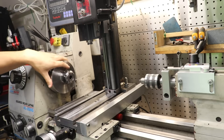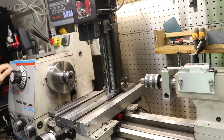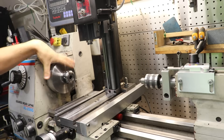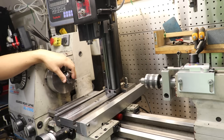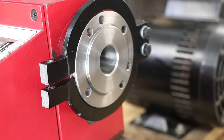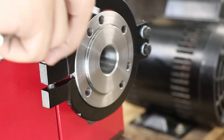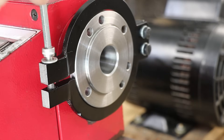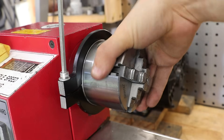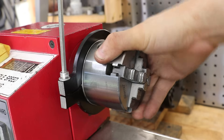However, it's not so straightforward because in addition to doing all the drilling and the milling, I also need to index and rotate the part. And I also need some sort of spindle lock to hold the part steady. Now making a spindle lock for a lathe isn't exactly uncharted territory for me, because I did do that with the old mini lathe and it was quite a successful project — just a simple split aluminium ring that would clamp onto the spindle and that was all bolted to a bracket which connected to the headstock.